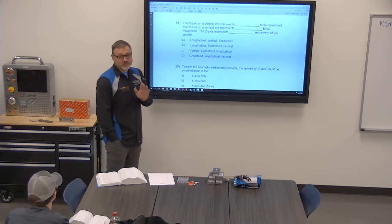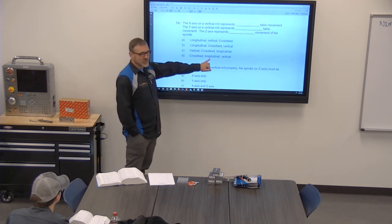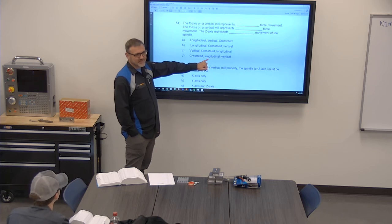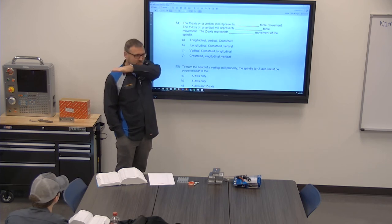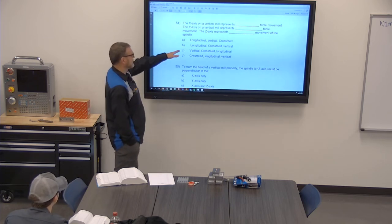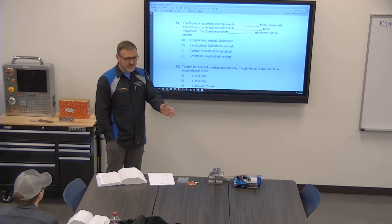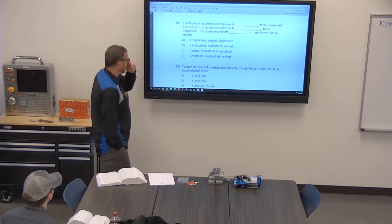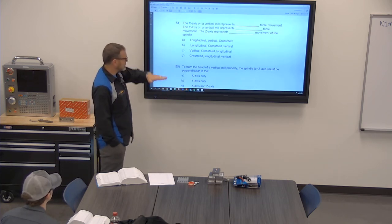That's really good as far as when you're looking at multiple choice style questions: eliminate the ones that you just know are not right. So I'm assuming the one that's getting you is longitudinal. Think about latitude and longitude. If I were to write this question, it would be: is it my left and right? Is it my forward and backward? It's my cross feed, my longitudinal feed, my vertical feed, X, Y, Z.